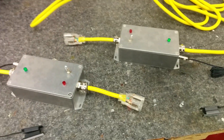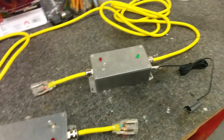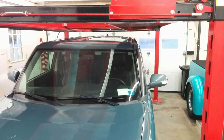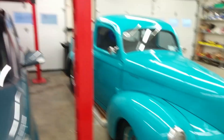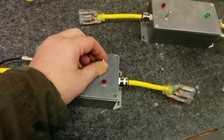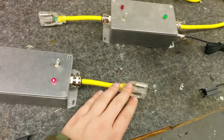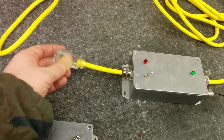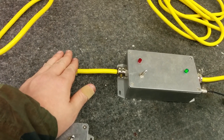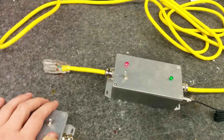It's just a peace-of-mind kind of thing. And for one additional scenario — like right now during the winter months when I park my car underneath the lift and my street rod off to the side — I want the lift to be up and still use the garage door. So I added a bypass switch. If this side is the garage door, I put it on manual bypass and the garage door stays powered on all the time no matter what. That likewise disables the lift completely. You can do a manual bypass on this side too, so they just become elaborate extension cords.